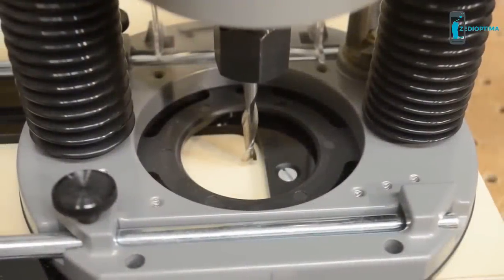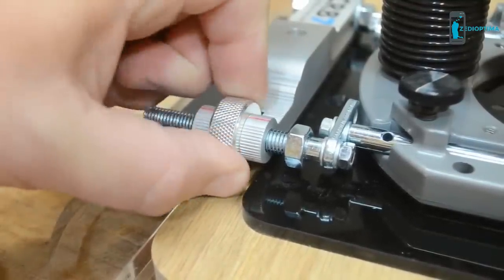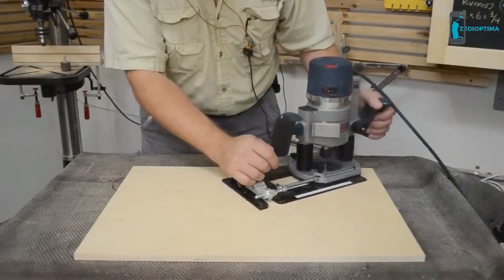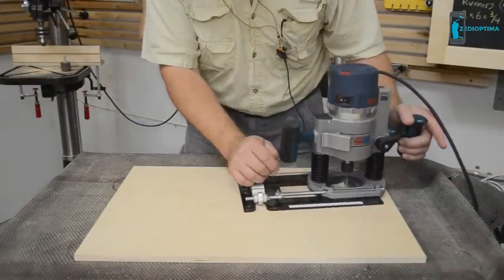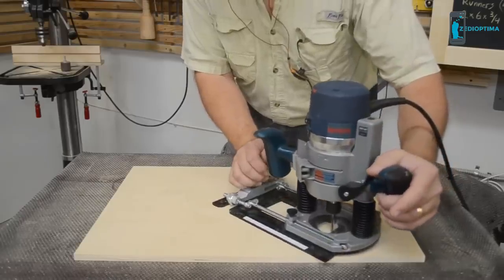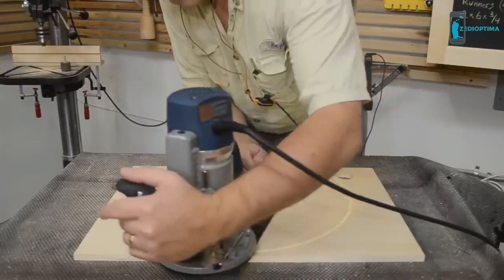After setting the pivot pin into the proper hole, the exact arc of the circle is set by using the micro-adjust wheel in the bridge of the CRB7. This not only allows for cutting circles and arcs at very accurate measurements, but also allows for cutting multiple arced pieces that will fit together accurately and consistently.